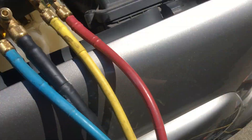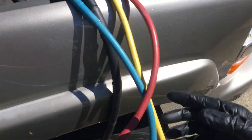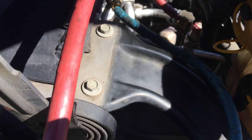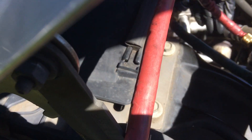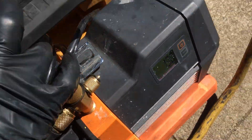I know how low this is going — if I'm at 19 microns there, I know I'm at least 500 microns at my gauge fitting, so that's good to go. Now I'm going to open them back up to the system and you'll see this jump up to like 500 or so. It's staying there.